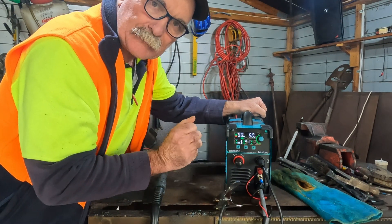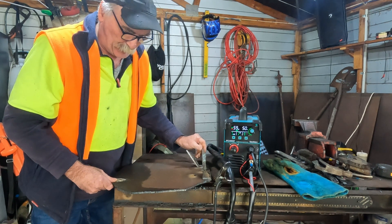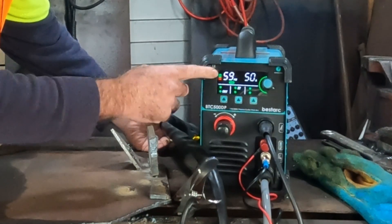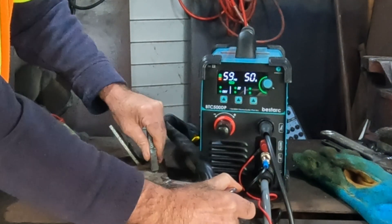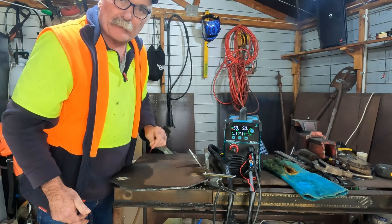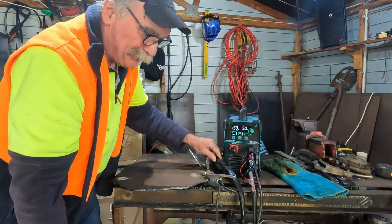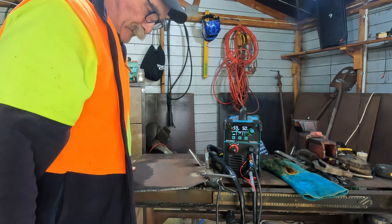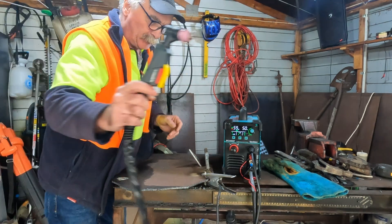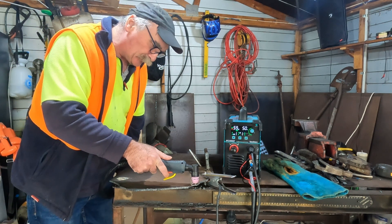Let's do a little bit of cutting at 60 psi and see what happens. We've got a 5mm hunk of steel plate here that's had bits and pieces welded onto it. We'll see if we can cut it with the factory settings — 59 psi, three green bars showing. Put your earth clamp as close as possible to what you're cutting, remember that. And another thing: if you have your torch lead hanging underneath your table, chances are you're going to burn a big hole in it — like Pete did the other day. Try and move your stuff away from where the hot stuff is going to fall. Anyway, straight out of the box, let's see if it'll cut.